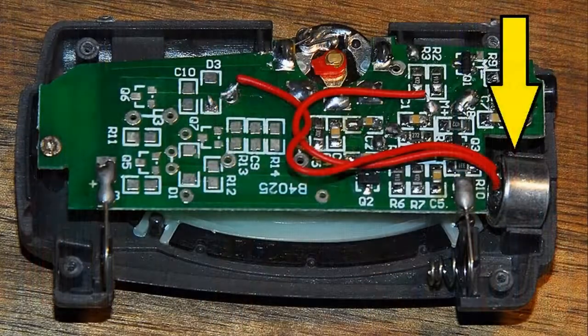It's very cheap, but the amplifier and the microphone are both quite high quality. If you open up the device you'll see the microphone is connected to the printed circuit board with some flying leads. You can unsolder those leads, attach a new cable to the microphone, and then remote mount the microphone.